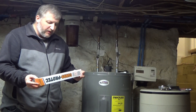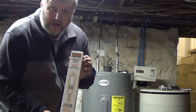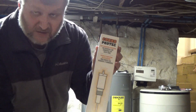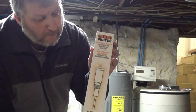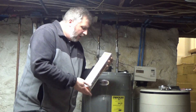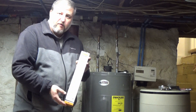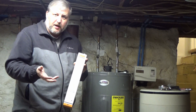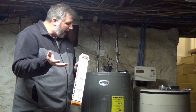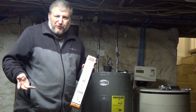I'm going to replace it with this — it's a Corro-ProTec, I hope I'm pronouncing that correctly. It's an electric anode rod. I paid a pretty penny for this thing — as of January 3rd, 2023, I paid $149, which is quite a bit of money. It's supposed to use electricity to interact with the minerals in the water heater instead of using zinc, aluminum, or magnesium to attract those minerals and give off that byproduct, which is sulfur monoxide or dioxide — I'll put a description up here.